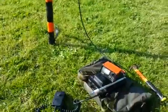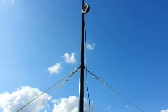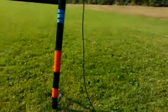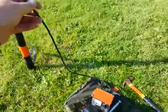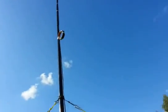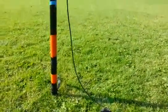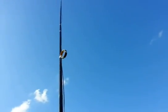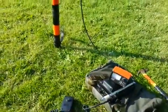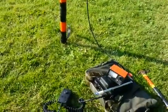Okay, all wired up. I'm not going to go through checking the SWR because I'm sure you all know how to do that — if not, don't be afraid to ask a question. You may notice I've not got much slack on the cable, but I've got enough. Bear in mind this is a nine-metre pole that's up. If you've got a shorter pole you'll have more left, but that is more than enough. If you've got a 10-metre pole you'll need a bit more. I'm going to go ahead with testing the SWR and I'll show you the results. It's leaning a bit — about straight now — right, catch in a minute.